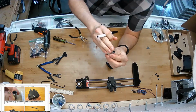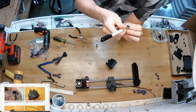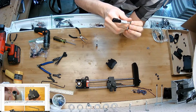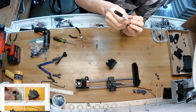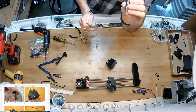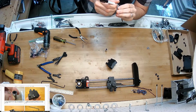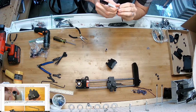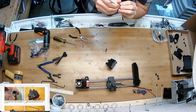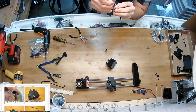and mark. So inside, if you look down the hole, there's 4 rows of bearings. I'm going to mark the pin right there to show. Yeah, that's good enough. Oops, I'm trying to be accurate. To show right where a line of balls is on that, and that will help in a minute when I'm assembling it, and it gives you a tiny bit of adjustment that you can apply to make your assembly tighter or looser. There, that's good.